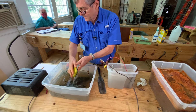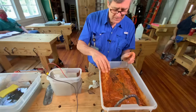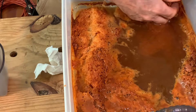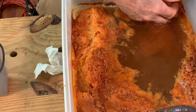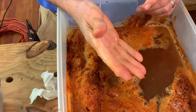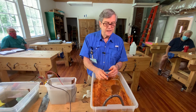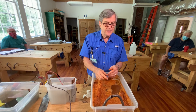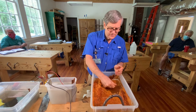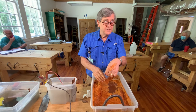That's basically how simple it is. You can see this old tub full of nasty-looking foam — this is particles of rust that have come loose. Because the solution is basically soapy, it leaves this lovely suds on top. But nothing in here is harmful. You can dump it out in the backyard or down your drain — there's nothing toxic in it. I'm not wearing gloves. If you have sensitive skin or a sensitivity to laundry detergent, you may want to put some gloves on, but this is such a mild alkaline solution that it doesn't cause me any problem. It will stain, but that's basically how easy it is.